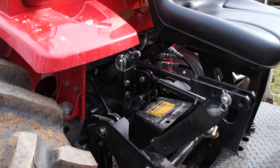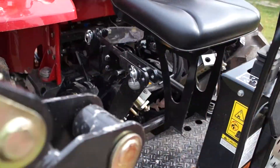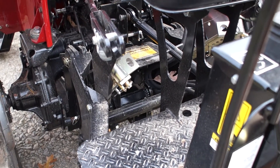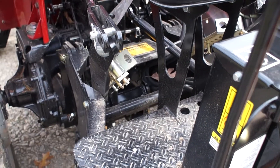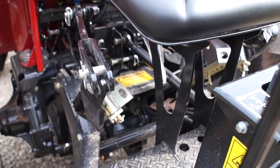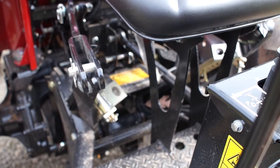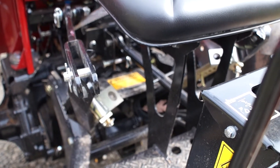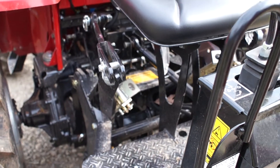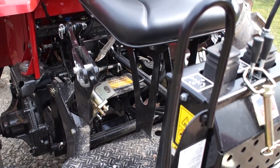It's actually down underneath that guard there where it says warning. It's kind of hard to see the PTO itself with the backhoe on, but it's in there. Once the backhoe is taken off, if I wanted to run a mower or something. But the main thing about the power takeoff is when it's running, you want to stay away from it. Any kind of loose piece of clothing — a shirt sleeve — could get caught on that and literally just rip your arm off and do serious bodily harm. So you want to stay away from the PTO while it's running, and make sure that if you're working with somebody else and you're about to turn it on, make sure that they are clear from it.